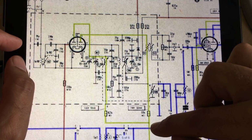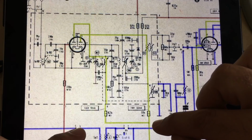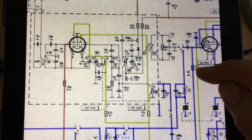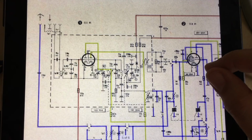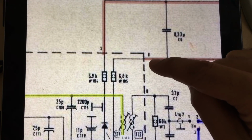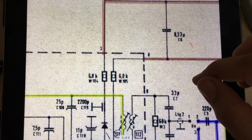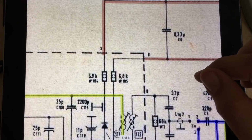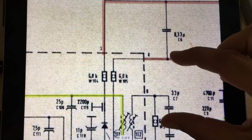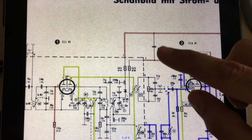So a power supply line comes here, joins these two resistors, and these are actually soldered onto that connector, connected to a common pin that's not used internally. And then those resistors go off to those two pins. That's there. And then we have these two pins in here, number 3 and 8. Can't read this too well. It's very, very vague on the schematic. But I think they're in the right place, and by opening the can, I can make sure that they go into the right connector, because these two could well be reversed. I don't think they are, but they could be.